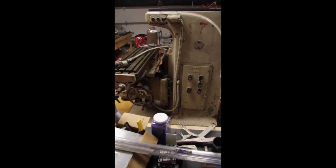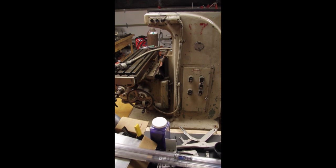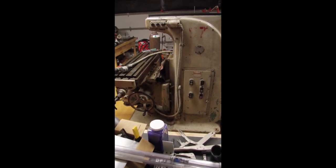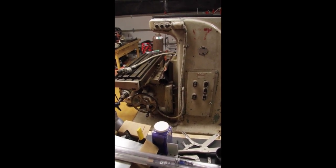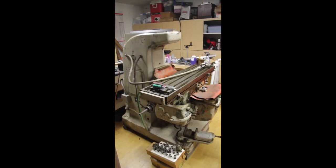I'm going through and doing lots of cleaning. I'm going to be doing some painting, and then we're going to wire it up. I have a VFD — a variable frequency drive — on order to power it. It's a three-phase 230-volt motor, so it should be pretty easy to convert to single-phase 220 with the VFD.